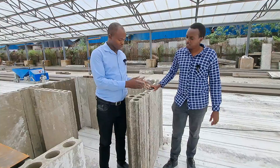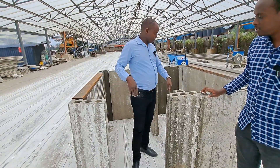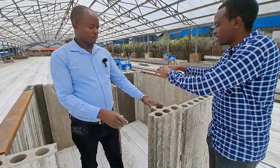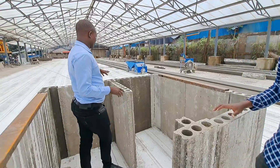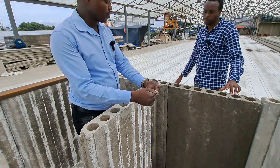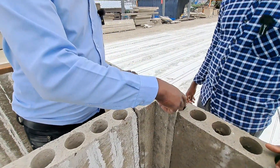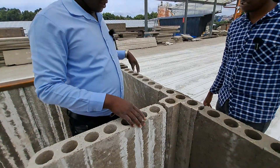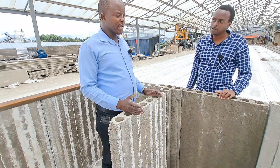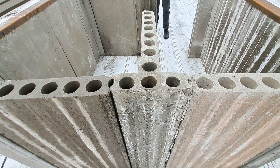So this will fit in between precast panels. Assume this was not a demo — you will now have another precast panel protruding this way and another one protruding this way, so it makes it easier to partition rooms. For example, this was a living room and this is a bedroom. This is the T panel — it will receive precast going this way, precast coming this way, and now the partitioning one. It will make your work very, very easy and very simple.